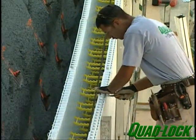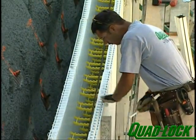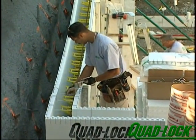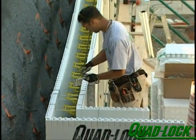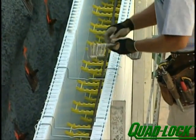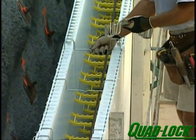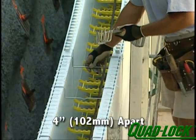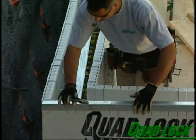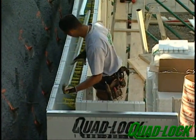After setting the top row of panels, remove the interlocked knobs and secure the panels with wire-top ties instead of plastic ties. Each panel pair gets three wire-top ties: one at each end and one in the center. At the butt joints, wire-top ties should appear 4 inches from one another. Then set the metal track over the panels to lock in the wire-top ties.